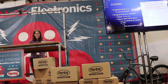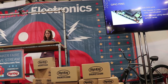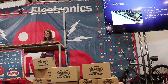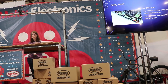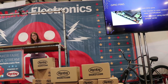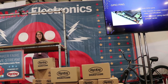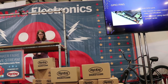Speaking of GPIO pins, there are 40 of them broken out on the board. A convenient feature is that the header on both versions of the TinkerBoard is color-coded, so you can see each pin's function really easily. Green is your general inputs and outputs, red is 5 volts, the yellowy mustard color is 3.3 volts, black is ground, and the two blue pins are SCL and SDA for I2C communication — my personal favorite.